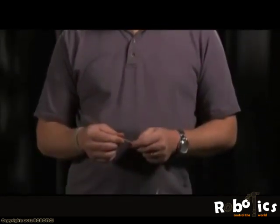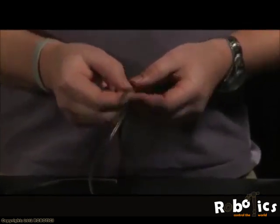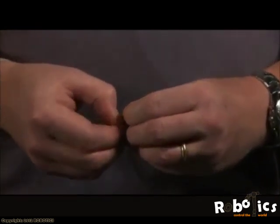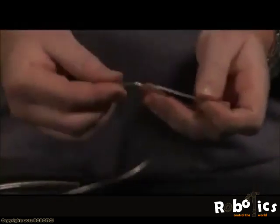Our next step is to put together our power cable that we'll use to connect our controller and everything to the batteries. In the kit, we have some gold and silver speaker wire. We'll start by splitting apart the two sections. Usually just takes a good fingernail to split them apart. And we're going to split them apart for about a foot, so we have two individual strands.